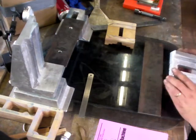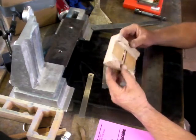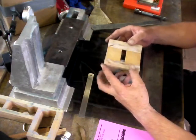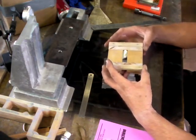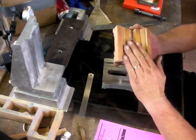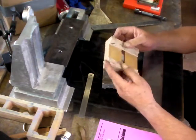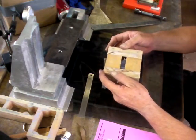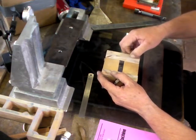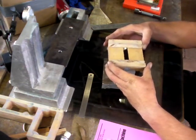It takes a fair bit of work to do it. I noticed also that there is a slight amount of misalignment of this side in relationship to 90 degrees on this side. But as the book says, you file the clamps to bring it around square to the table.